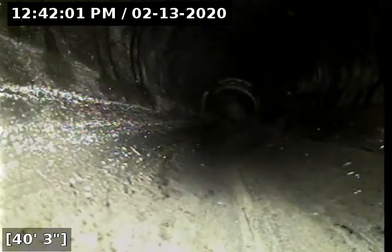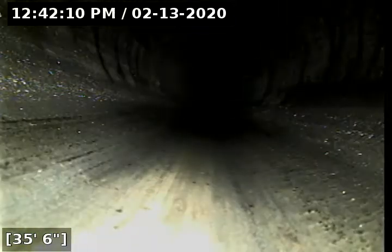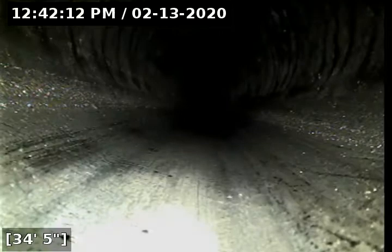So this is, it's black in color, it's plastic, so it is flexible in nature. So what I'm checking out for is any sloping issues, because when you install this type of plumbing material, you want to make sure that everything is supported properly and it's underneath the crawl space. If it's in the foundation, then you want to make sure the dirt is compacted properly. So that's why, a few reasons why I ran the water. Typically, you will not see roots growing into this type of material.